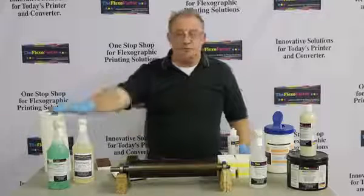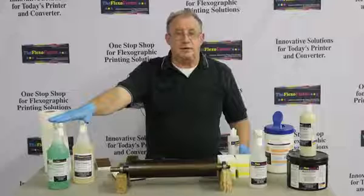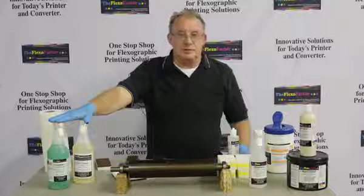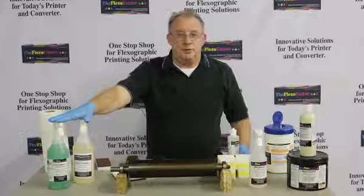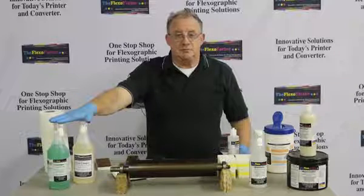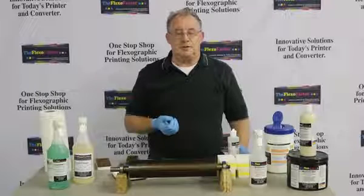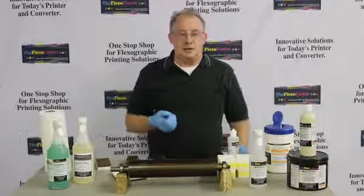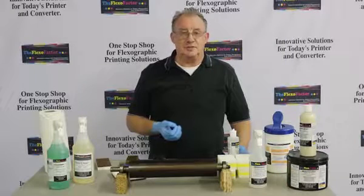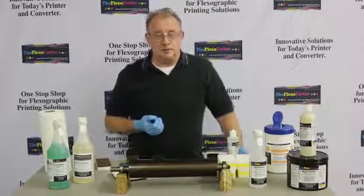You can use one of our regular water dilutable products, our Real Clean or Plate Clean, and they will do very well at removing the superficial ink from the surface and within the cells, but they're not quite as strong as the Eliminator, and really the Eliminator is proven to be able to get down deep into the porosity of the coating, almost like a mechanical cleaning action, but we would still recommend ultrasonics as a finishing solution should you want to be absolutely 100% clean with your rolls.